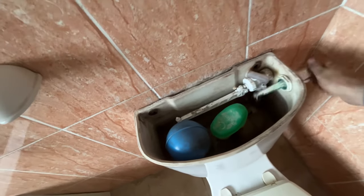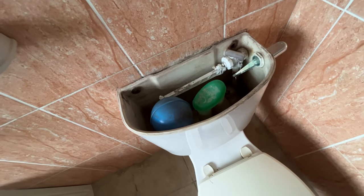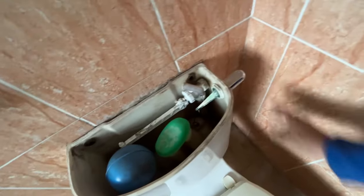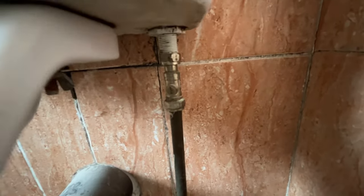It's not really doing much. I think if it's flushing like that all day it won't work. As soon as I stop filming it flushes, but you've got to really pump it. So we'll isolate that for now overnight so it doesn't overflow. Then come back tomorrow, change the fill valve, change the siphon. Hopefully just have a look at what the cistern box is like.